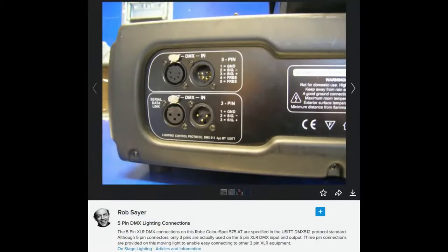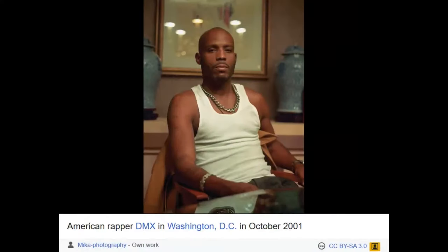If you're wondering what that's used for — you don't have to use them for DMX, but a common use for RS-485 is to be the lower physical layer for DMX, which is a control system for special effects and AV equipment. It's a really old protocol that's been around for a long time. I looked it up and no, DMX is not named after the rapper — it's actually a totally different name.